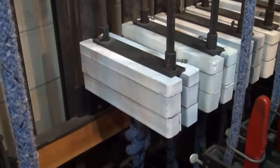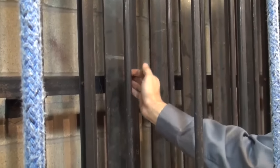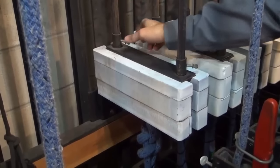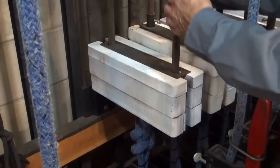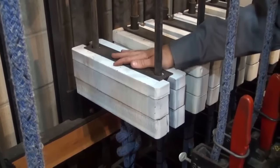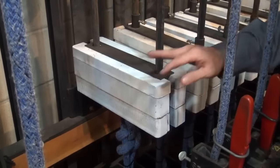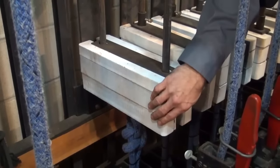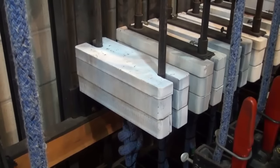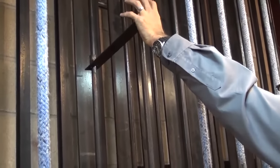Spreader plates should be located every 24 to 30 inches of counterweight stack. It's prudent to mark the arbor backbone with contrasting color enamel paint to indicate where spreader plates are located. There must always be at least one spreader plate on top of the counterweight stack. The correct method: lift the spreader plate as weights are loaded until it reaches 24 to 30 inches, leave it there, continue loading, and keep a spreader plate on top with the locking collars.